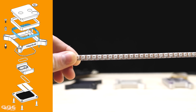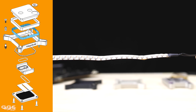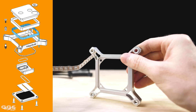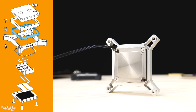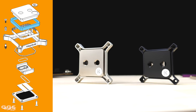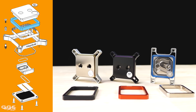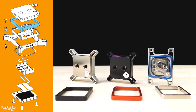All digital RGB versions of Magnitude use the same high-density LED strip with a total of 30 addressable RGB LEDs. On plexi versions they illuminate inwards, and with their opaque tops they illuminate outwards. The LED strip must be inserted through the frame, and the wire can exit the block on any of the corners for best cable routing. The accent piece is CNC'd from solid blocks, with standard accents being nickel-plated brass or white acetyl. Several anodised aluminium accents are also available in black, red, blue, purple, gold and green.